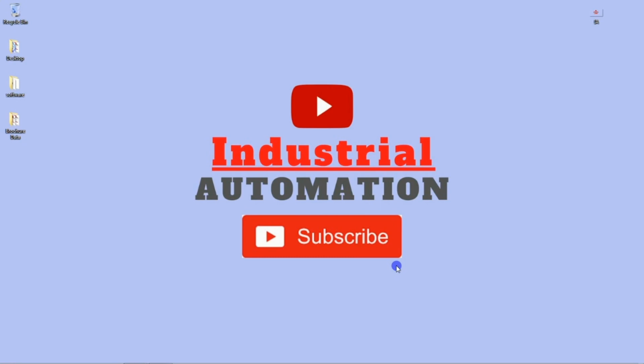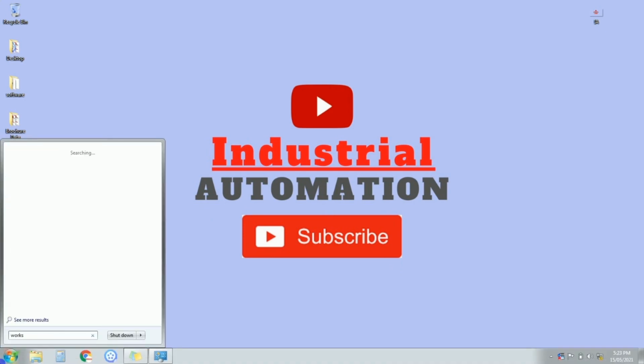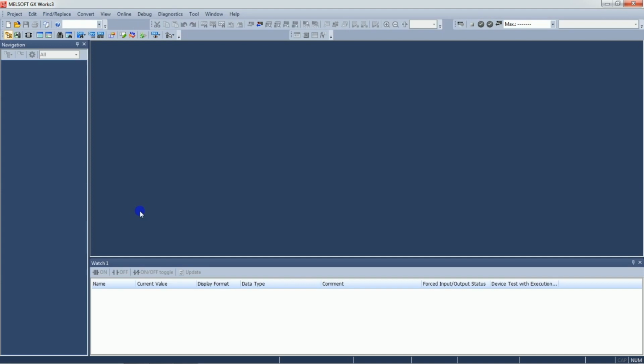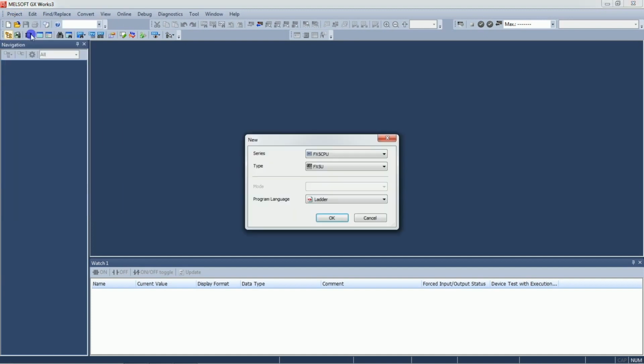So in this tutorial I will show you how to connect Mitsubishi PLC, that is FX5U CPU, to Kepware server or NI OPC server. Okay, so let's start. Open GXWorks3. Okay, we have the PLC model number FX5U. Let's create new project. Select the Mitsubishi model number FX5U. Click OK.